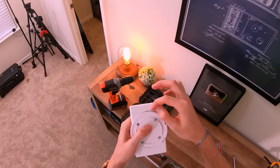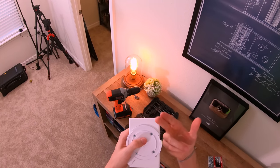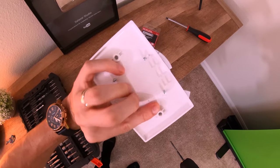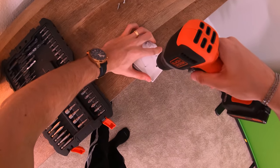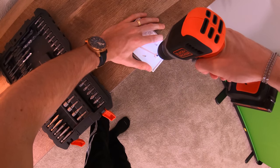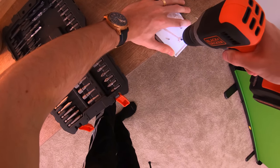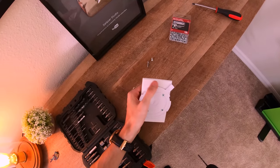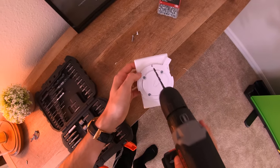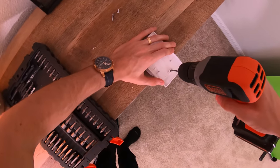Then we need to drill a couple of holes and then take a Dremel, preferably, and kind of bore out a large hole for our Ethernet cable to pass through. Right, so drill from the back of these. Typically you'll have these little channels here, so you can drill straight through those, and you won't really need to pre-drill. Go. See, the hole barely fits, but even if it had broken this little frame here, it wouldn't have mattered because this part is not needed necessarily to lock it in place. It's these little indentions here. And do the same for the other side.